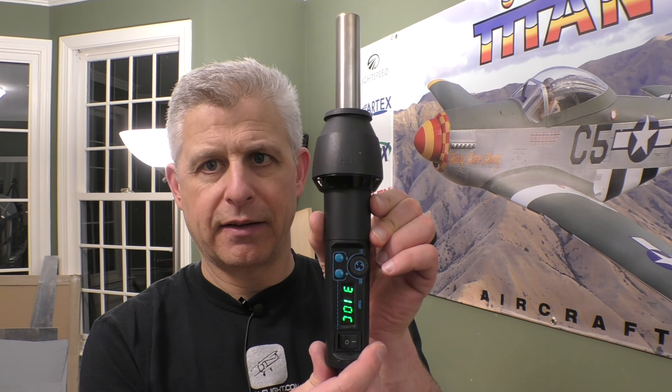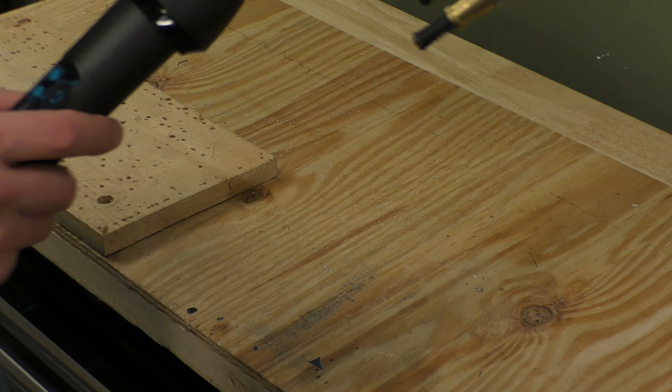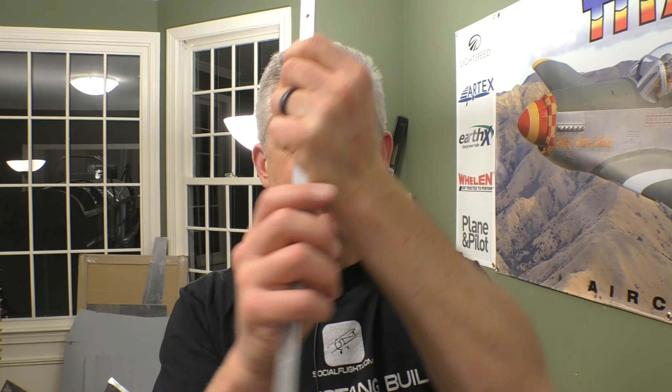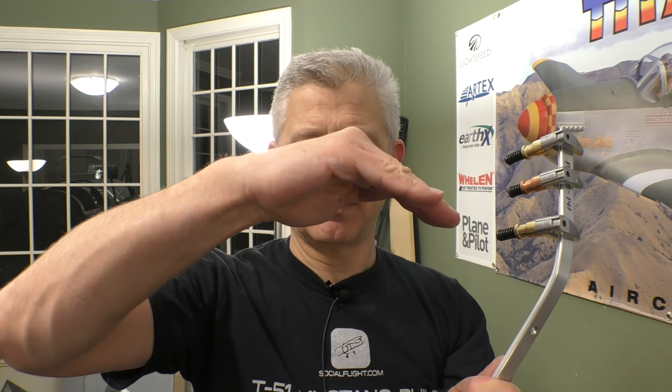For getting this nylon strip to fit, I have this precision heat gun that I really like - it's for electronics, small and very targeted. You can set a digital temperature on it. Just a few passes and it basically relaxed the piece right into place - exactly what I needed. It didn't melt or anything; I could just see it relax and come right in line with the aluminum.